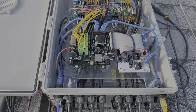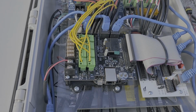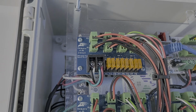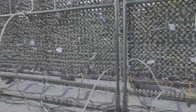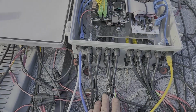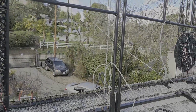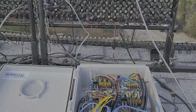So, to make it a little more clear, you'll notice on my K8, I only have data coming out of the controller. I do not send any ground or any power out of it. All the ground is tied in at the bottom at the power supplies themselves, and then data is connected in to the distribution boards here. That allows me, for this particular matrix, to easily just use 2 power supplies to run it and be able to identify without worrying about crossing the V+ of what's covering what. The third one is actually extra. You'll notice it's not in use. I was going to put it on my spin arches, convert those to 5 volt. I didn't, so that just sits there blank. I hope that makes sense.